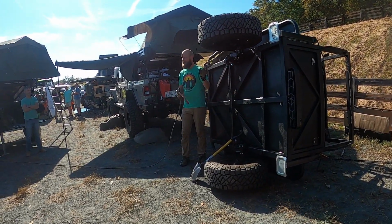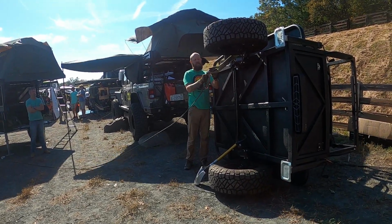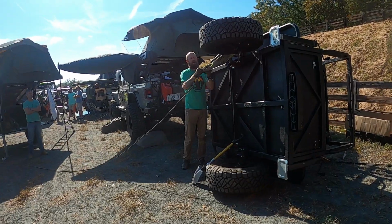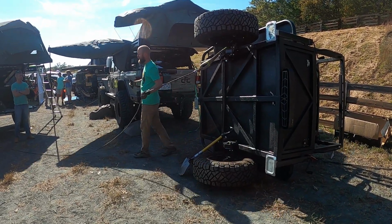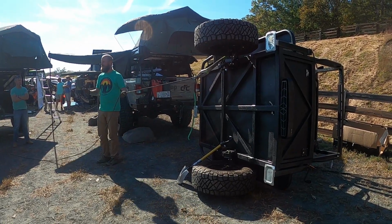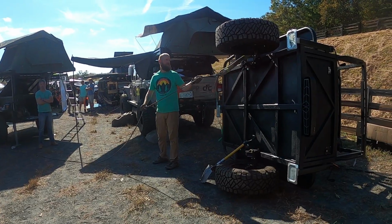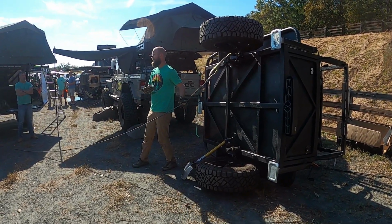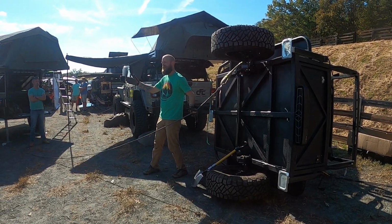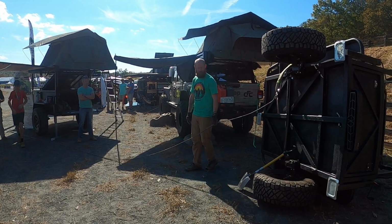But once I'm ready to make this connection, right, I make the connection. Here I've got a webbing hook on my winch, so I don't need to worry about any type of soft shackle or bow shackle there. If I had maybe one of the cheaper hooks or one of the smaller hooks, I may have to, but in this scenario I don't. Now I'm not coming in 100% perpendicular, right? I just can't get the angle. So there is a chance I could drag this trailer a little bit, okay?